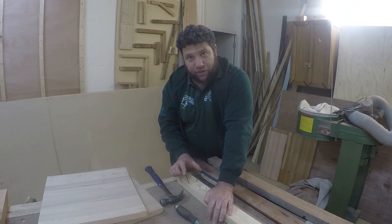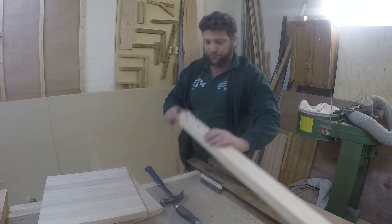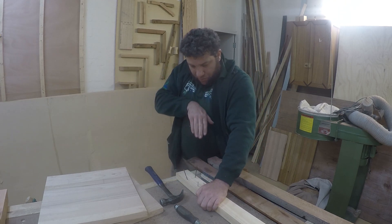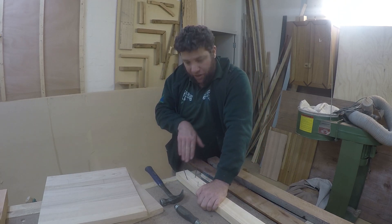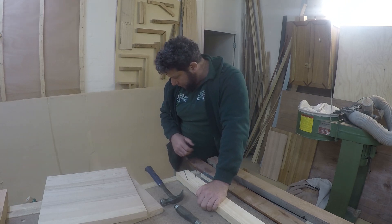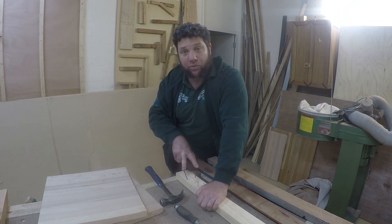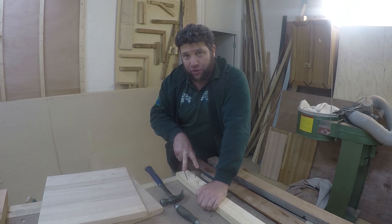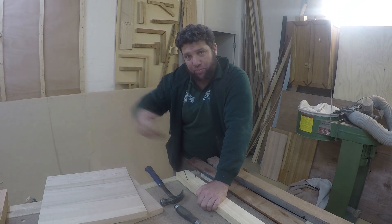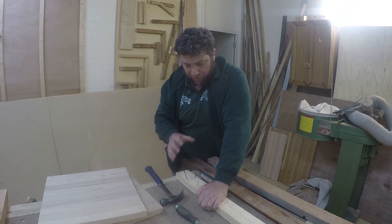I've put two nails here. You can see that the two nails come in on angles — this is called dovetail nailing. The reason I like to dovetail nail is because by opposing the angle of my nail, it pulls my material into position. That's what I want to be doing — pulling my materials together. This is actually an old technique I was taught when we used to lay floors directly onto our joists. We dovetail nail, and as we dovetail nail, we pull the decking board or the flooring board into position and lock it tight so it didn't move.